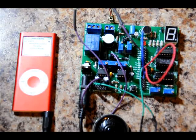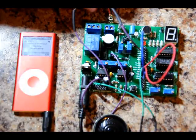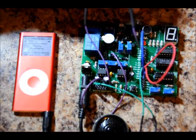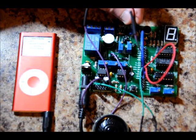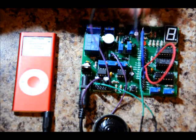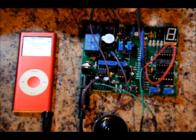It's not tuned. So this is the final product. I've got my iPod plugged in. The iPod has a stereo output, which means it's got left and right channels — we're only using one channel, I believe it's the left. So we're not going to be able to hear all of the different tracks of the song, especially the drums. We're going to play Baba O'Riley by The Who — Teenage Wasteland. If you don't know the song, it starts off with an instrumental. I've tuned my gain resistors to the best of my ability. The audio quality is not fantastic, but let's give it a try. I'm going to move the laser off of the LDR occasionally just so you can see that I'm actually using the laser to do this. I'm going to turn off the lights so you can see the laser better.